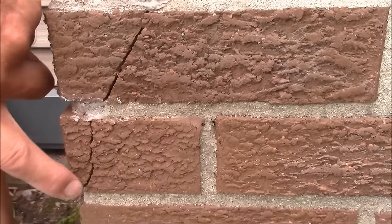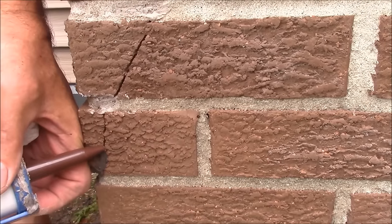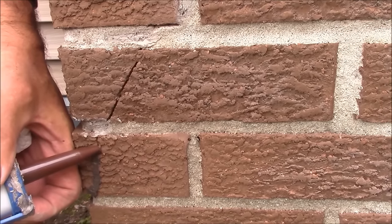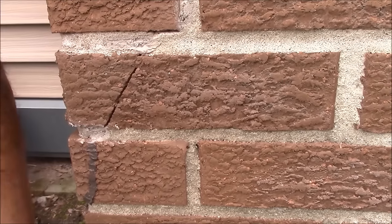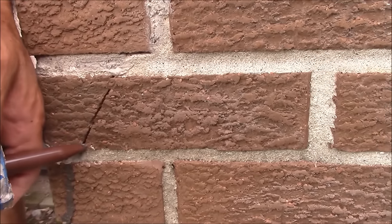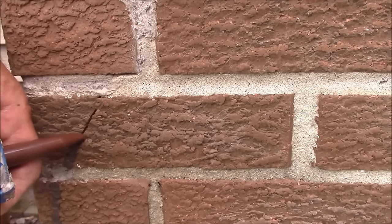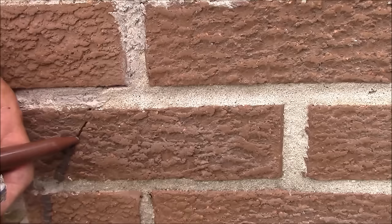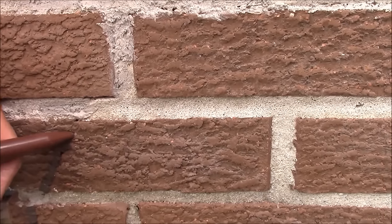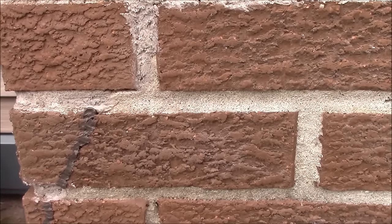What I have is a brown caulk — I didn't have a brick red — so I'm going to show you how to finish this job up. We don't want gray running to the middle of the brick; we have something that looks a lot better than gray. I cut the tip very, very small so I can drive the caulk into the crack, leaving the smallest line possible. Mind you, you are not going to be able to clean this, so you put it in neat — you get one stab at it. It's not an exact color, but it's going to look better than gray, and the important thing is we're waterproofing the brick again.